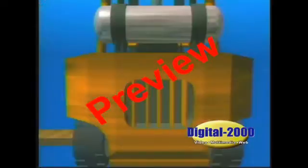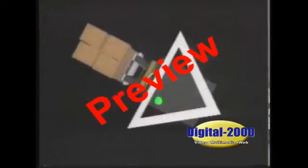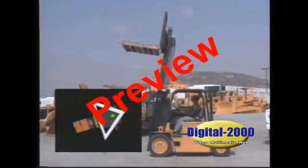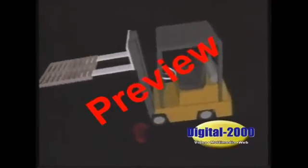Let's look at the stability triangle of the forklift, which is created by the front tires forming a triangle to the center of the rear axle. Forklifts are engineered on the three-point suspension system. The first two points are the front tires, and the third point is the pivot pin on the rear axle. The pivot pin helps the rear wheels move up and down as the rear tires move over bumps or uneven surfaces. The center of gravity must always remain inside this triangle, or the forklift will overturn. If you raise a load, the center of gravity shifts toward the front tires. If you make a fast, sharp turn, the center of gravity shifts toward the side. If you have a raised load and tilt the forks back, the center of gravity shifts toward the rear of the triangle. Tilting forward shifts the center of gravity toward the front. Overloading your vehicle shifts the center of gravity toward the front too. The forklift will overturn if the center of gravity exceeds the lines of the triangle.